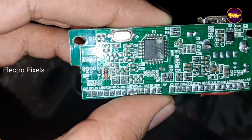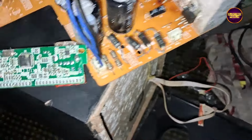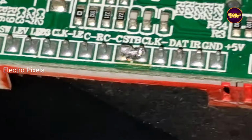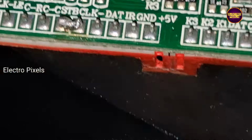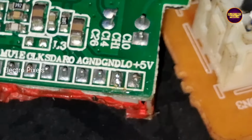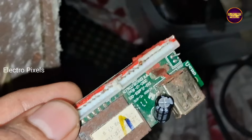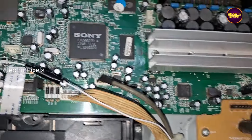First we need to disable the standby mode. For that I joined the standby signal with the power on pin. By default this board will be in Bluetooth mode. Now as previously, we need to connect each point according to this board's circuit diagram. Here L out and R out are the left and right audio signals. We can fix this board's connections in sockets, so now let's fix this.